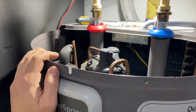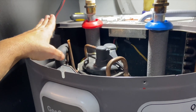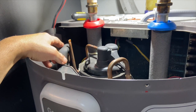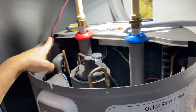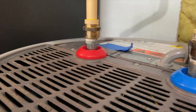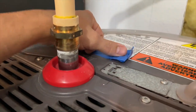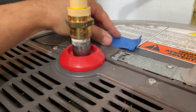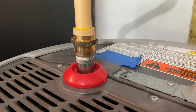You may wish to buy the factory anode rod yourself. The torque spec on this, by the way, said 7 to 8 foot-pounds. I got it tighter than that, so I'm just going to leave it — I just got it snug, not hulk-torqued down or anything like that. From here I'm going to go ahead and put my water heater back together. If you've made it this far, I think you can handle the reassembly. One last thing I've done for somebody in the future who might want to re-add the anode rod sensing function: I left the bolt and a little washer taped to the top of the water heater, so that option is available if somebody wants to do it in the future.